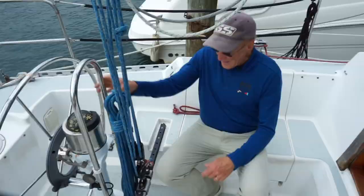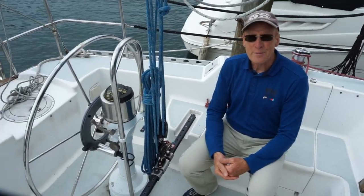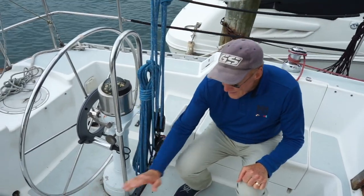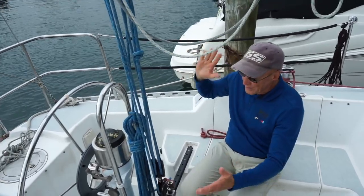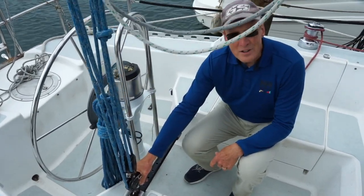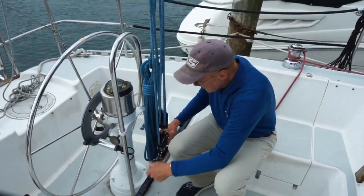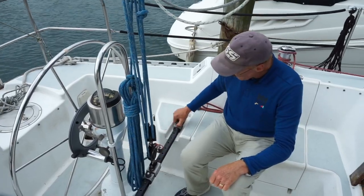This is our traveler, and what it's used for is to either spill or capture more wind. On heavy wind days, as you flatten your sail, one of the first things you might do is ease the traveler to leeward. So the wind is coming this way — if we were to ease it to leeward, we basically move this adjustment and the sail would slide to leeward. If on the other hand we had a real light wind day and we wanted to capture all of the wind coming off the sail, we'd move it to windward, just the opposite.